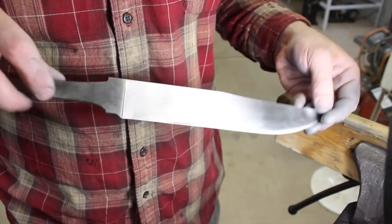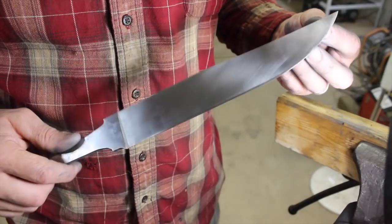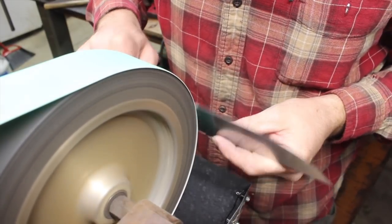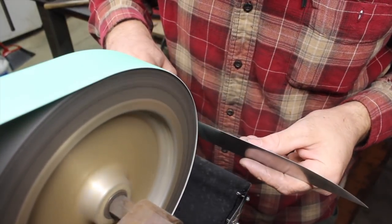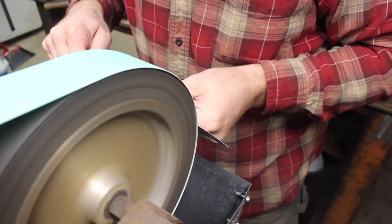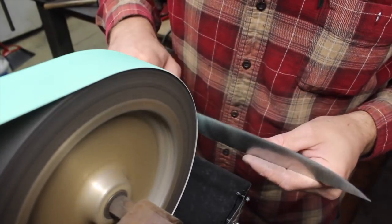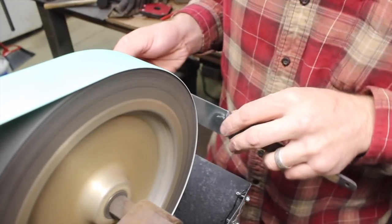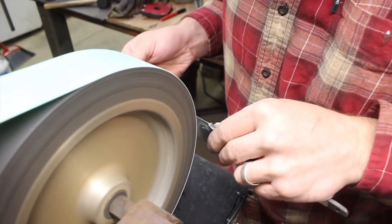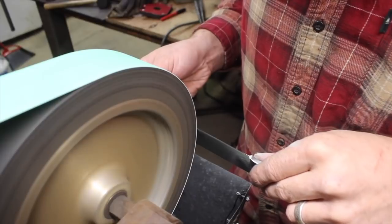Cleaning up the spine here. The blade is down to 600 grit finish, which is not as high as we need to go before etching, but that's as far as I'm going to go right now. The next thing I'm going to do is put an edge on the blade, and that is for the purpose of testing the blade before we go any further. I don't do this with every single blade that I make, but I do it fairly frequently — you could call it a quality control. So we're going to put an edge on this blade. This is the primary bevel at that ten thousandths thick edge.